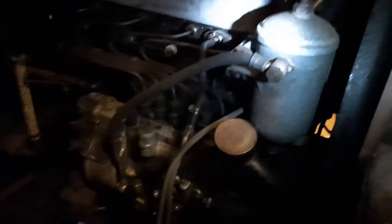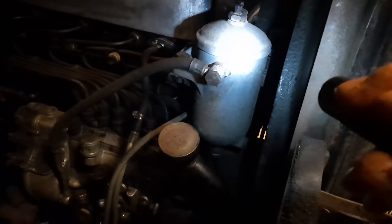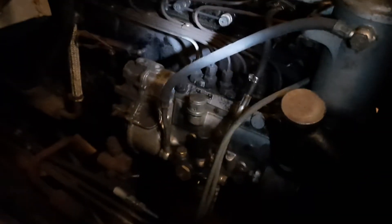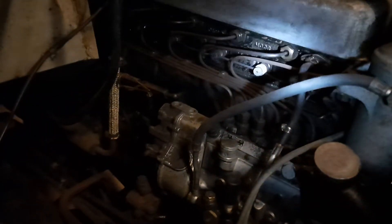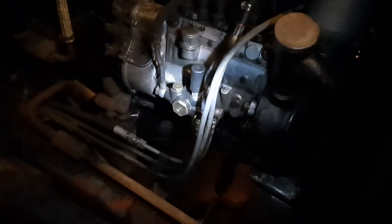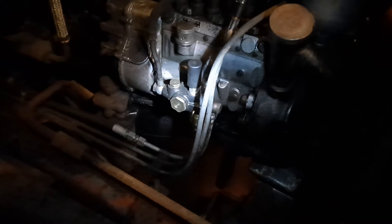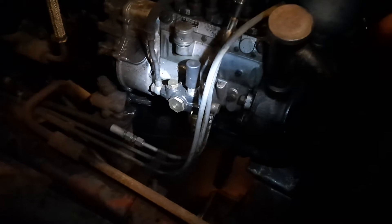Going up to the secondary diesel filter, really, before going into the engine and back into the tank. This is the injection fuel pump — the injection pump where you have all six cylinders here, and the return there. Right here I found myself a new fuel pump, a primary fuel pump. It's actually from a Unimog, but hey, it works just fine.